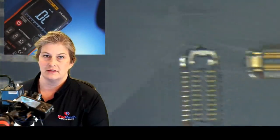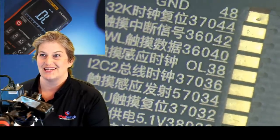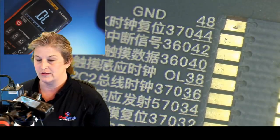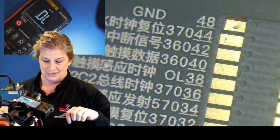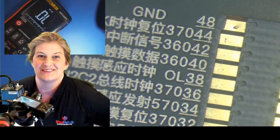All right, so I've got the iBridge attached to the connector, and I'm going to leave the screen off. I could put the screen on if I wanted to take a voltage measurement with the phone under power, but I'm going to leave it off because I think these diode mode measurements are generally done with the screen off, because the iBridge used to not exist, in which case it'd be mighty hard to take these measurements with the screen attached.